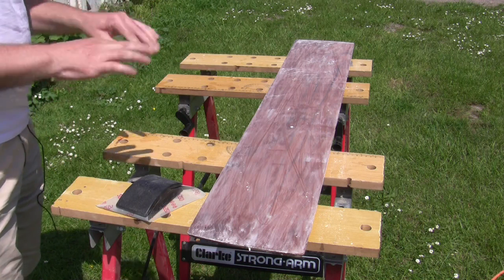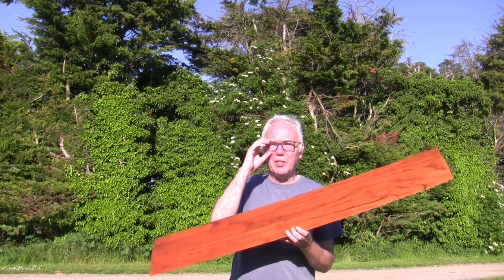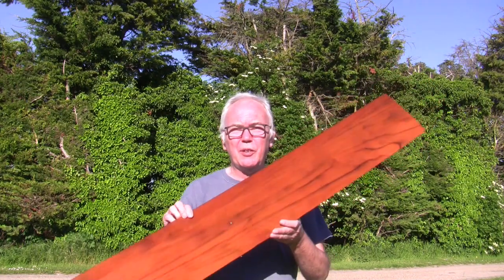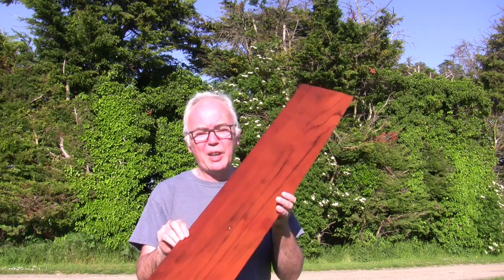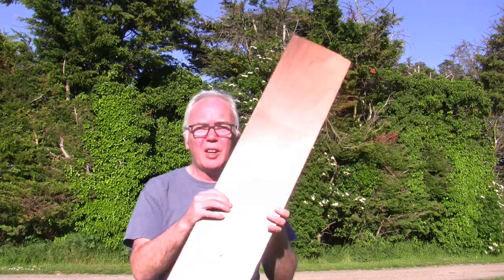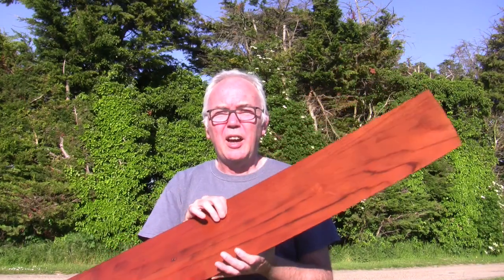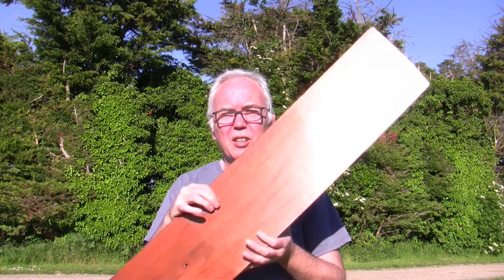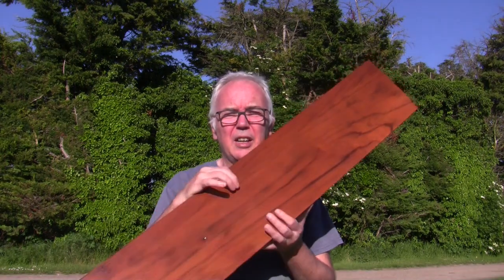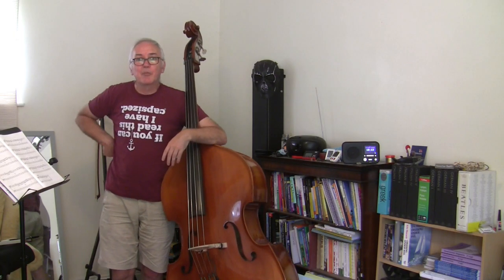Let's do the other ones, clean all that off, acetone it down, and then get the final coat on. Just a quick follow-up — the sun is right in my eyes, it's late in the evening. This is the satin finish. I haven't done it perfectly, mainly because I think I mismanaged the wet edge — I think there's one there and one there. I think I did the tipping away from the wet edge. But I like the satin. I think the satin over the shiny gives an absolutely perfect finish. So anyway, let's forget about varnishing for a bit — that is enough about varnishing.